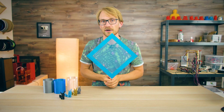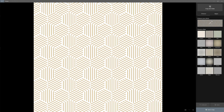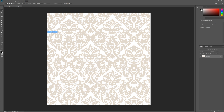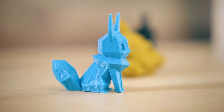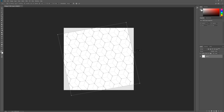Basics done! Let's show you five more tricks to get the most out of your velocity-painted parts. Number 1: Contrast. Velocity Painting works on edges basically, so if your design has poor contrast to start, give it a bit more contrast in Photoshop or GIMP. You can also play with edge-detect filters for a different look. Because Velocity Painting works per layer, if you have a design with continuous vertical bits, anything but the start and end of that bit aren't going to show up well. You can simply rotate the design ever so slightly — by 5, 10, or 15 degrees — so that you do get that contrast in each layer.